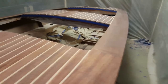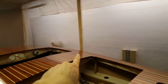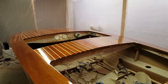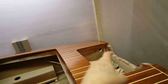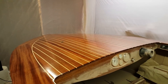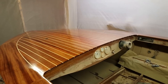Here it is after the third and final coat - it's pretty glossy, you can see the reflection of this two by four in the top. It's not a perfect surface but it's smoother than the second coat, which was smoother than the first coat. This is plenty smooth enough to do the clear. This is still very wet. I have peeled all of the tape off - around the transom, the shears on both sides. It's pretty smooth, plenty good enough for clear coat.